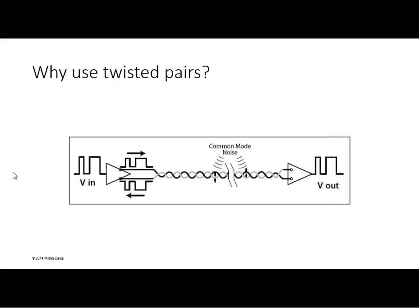Can I stop you for one moment? It would have been nice if we had put the return wire in that drawing. Either shielded or not, having the third connection, which is basically the reference point, matters, and it may not work if only two wires are connected. The third wire is not only the shield, it references the transmitter and the receiver to each other.